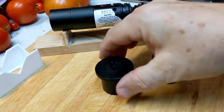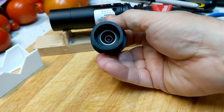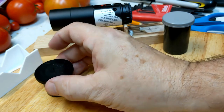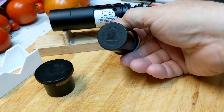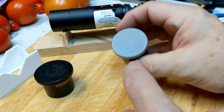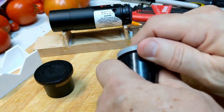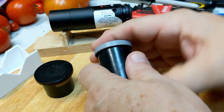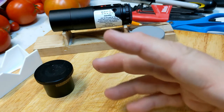Collimation devices are all over the internet and for sale just about everywhere. This one is an eyepiece-style — you just put it in and look through the top hole. Some come with plastic ones, and you can also make your own out of an old film canister: cut out the bottom, use the lid with a hole drilled dead center, and some will add a black ring on the inside as well. Both can be handy.